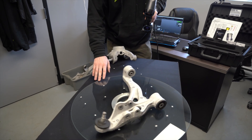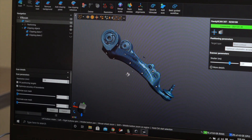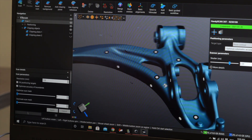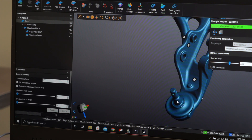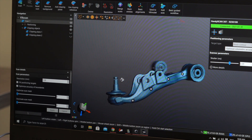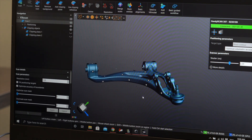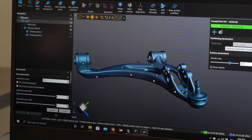That's really all we need to do to reverse engineer this control arm. The important thing is to pick up the critical dimensions we need: the sway bar pickup point, the shock mount, and the control arm ball joint. With all these points we can create cylinders, planes, cones, and other data to transfer into Fusion 360. These critical dimensions transfer over so I can reverse engineer my control arm from them. I can import this arm as a mesh file — it'll be visible but not editable; only the critical points will be usable.